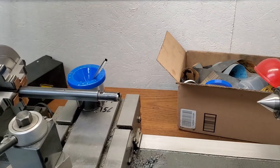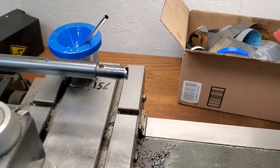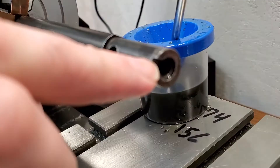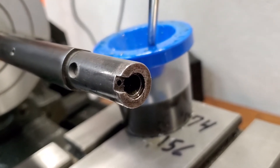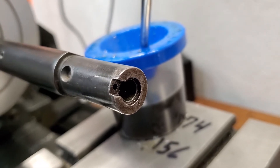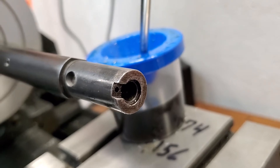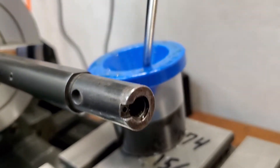I thought I'd do a short video of something that some people might not really be aware of. I had to drill that little hole right there for an extractor, which I still have to make. You can kind of see my scribe lines where the hole is drilled. Something like this you can't put in the mill, and you sure as hell ain't doing it with a hand drill — you've got to have a precise hole, so you do it in the lathe. The way you do that is you've got to offset your workpiece.